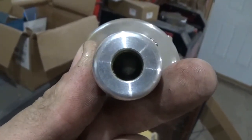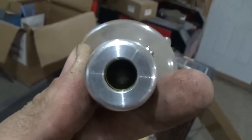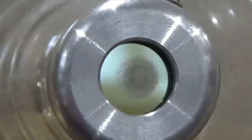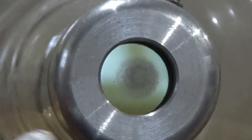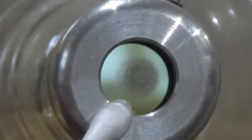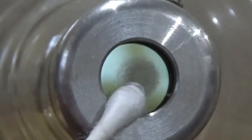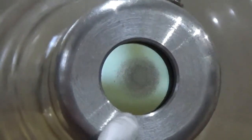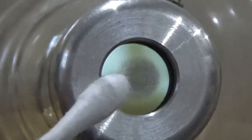So that mirror right there needs to get cleaned when you're on your last leg of the tube. Don't clean that all the time. But if you think your laser tube is bad, you might want to consider cleaning this. You should be able to see the haze inside the tube right here. Believe it or not, this tube's bad, so I might abuse it a little bit. That haze is not supposed to be there — that needs to be cleaned off. Say, six months down the road, you start getting a power droppage, everything's cleaned in line — you may want to consider cleaning this right here before you change out your tube or your power supply. So what you need is a Q-tip and some denatured alcohol.